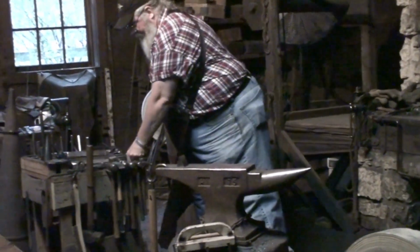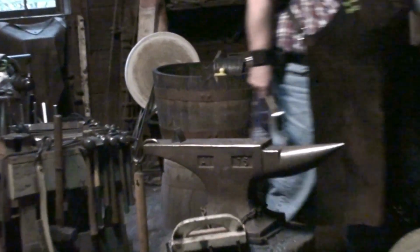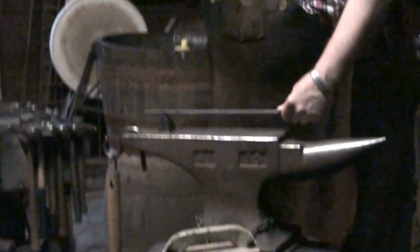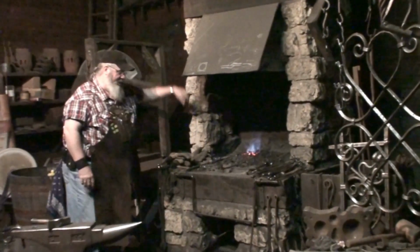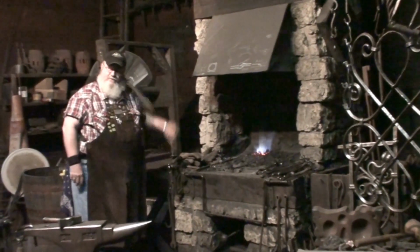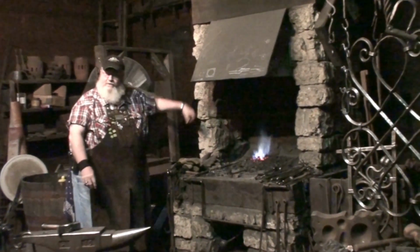One of the original tools is like this, a little sharp knife edge tool called a Hardy. When you needed to cut your steel, you'd heat that steel in your fire, get it up to an orange, almost a yellow glow. You bring that hot steel out, lay it right over the top edge of that Hardy, and drive it right on the edge, and that Hardy will push right up through. The steel itself is right at 2,000 degrees, give or take a degree or 2.